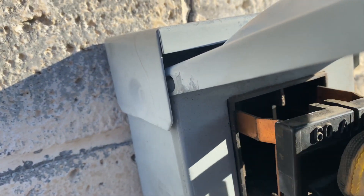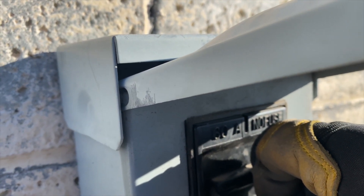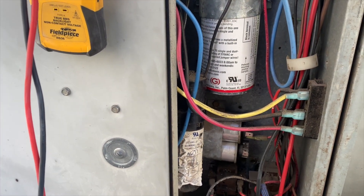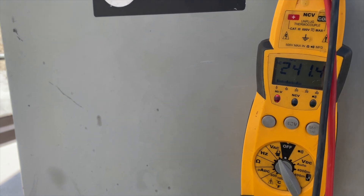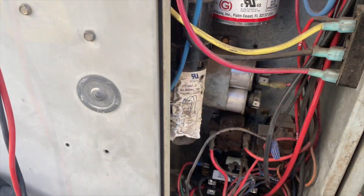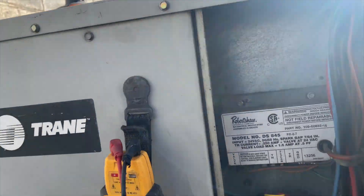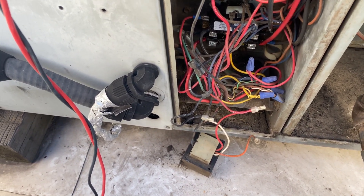Please don't pop. Looking good. Let's check to see if we have voltage — all right, we have 240. We're going to engage the contactor manually just to make sure it's not the compressor. Going to push in the contactors. All right, there's no short in the compressor. It sounds terrible though. Looks like we have a bad transformer, so I'm going to see if I have one on the truck and we'll get that swapped out.